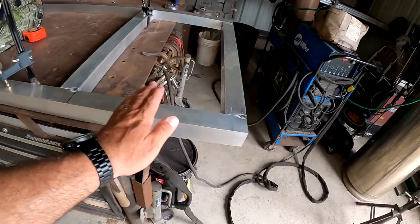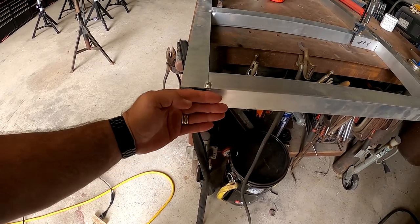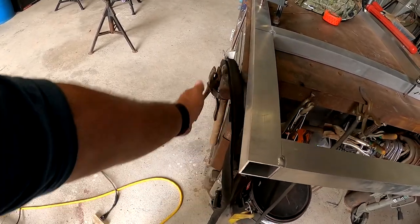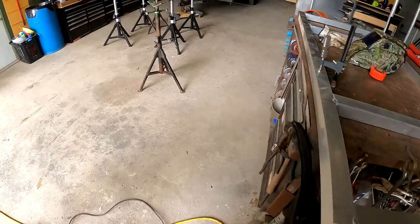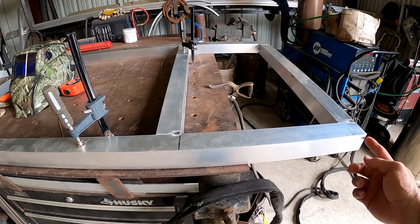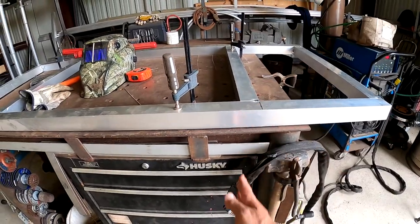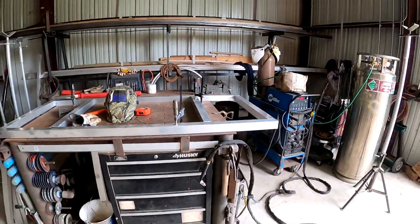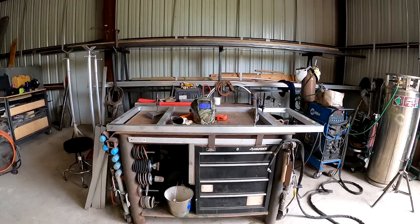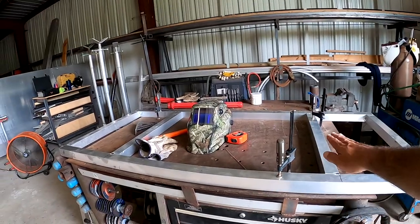And then when I make the plate come over here, I'll cut a piece to weld on here to cover up this end, but I'll probably come down about 6 inches, and then I'll cut a piece going this way to the leg, so it'll be a little like diamond piece, like wings on each side, like a gusset, but it'll be solid. It'll weld up here, and then it'll come down 6 inches, and then it'll go to there, and then I'll weld it to the leg there. So I think that'll make it pretty strong on the top, because I plan on putting some stuff up there, I don't know what, but if we ever do. And plus it'll dress up the front, because on this front, the pizza oven sits kind of high.